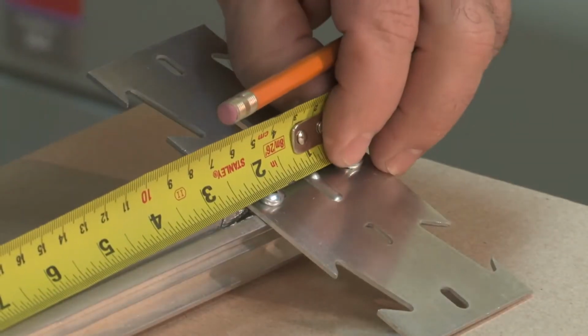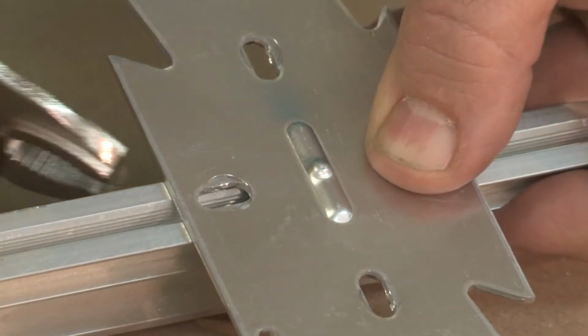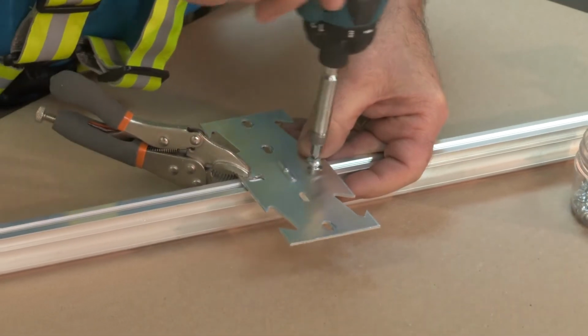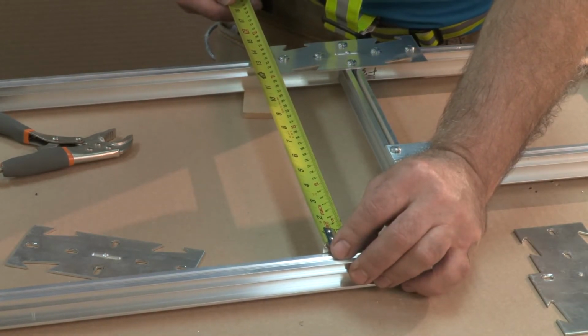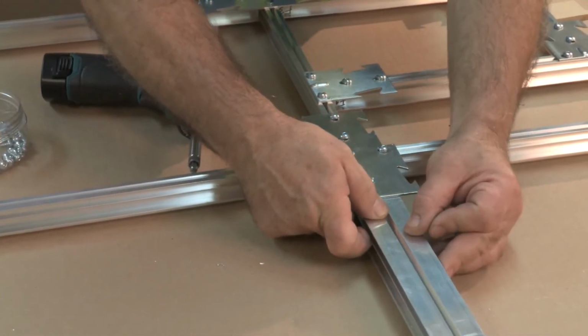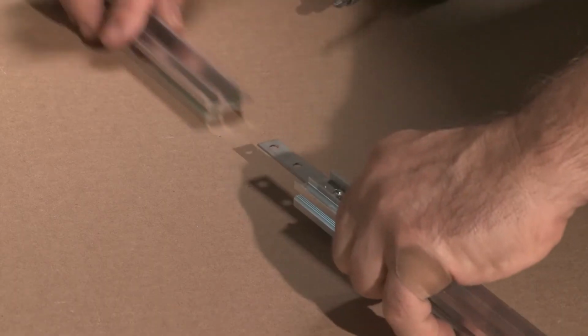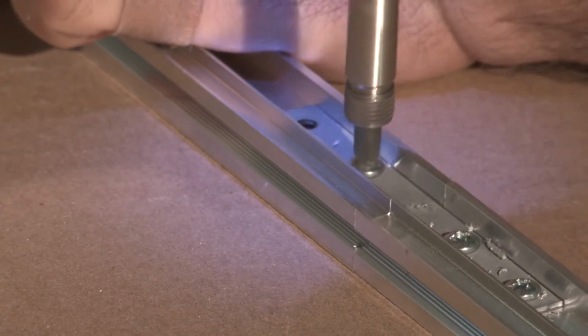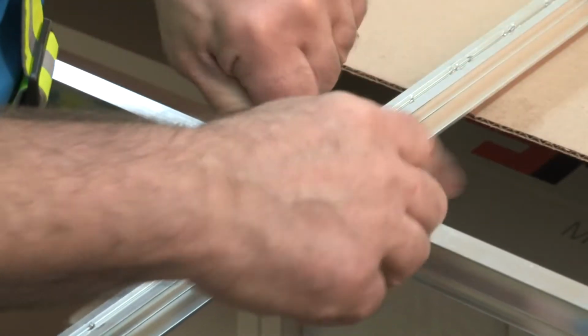Using the supplied grid layout plan, measure the distance between the butterflies, and continue to secure the butterflies to the grid. Continue securing the butterflies and grid together. It is important to only assemble the grid into workable ladders. Use a splice plate to join grid pieces together. If there are other areas of the grid that are weak, secure the grid together before moving ladders into the ceiling.